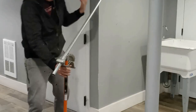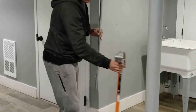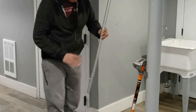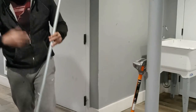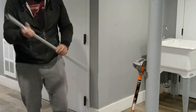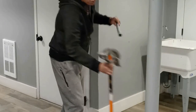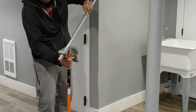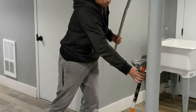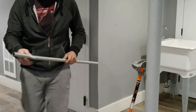That's basically it — it's very easy. Sometimes you might have to tweak it a little bit, but when you put the marks on it and bend to 10 degrees you should be alright, because you know exactly where your marks are and you can always go back to the bender and place it where it was before to fix them. That's why I always say: always place your marks on your bender, even if it's a small little kick or whatever the case may be.